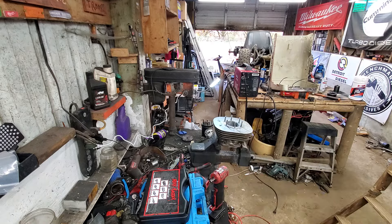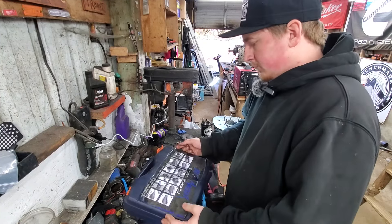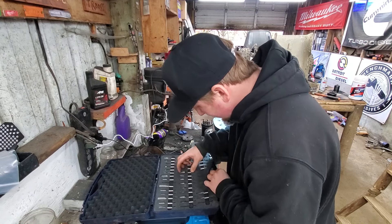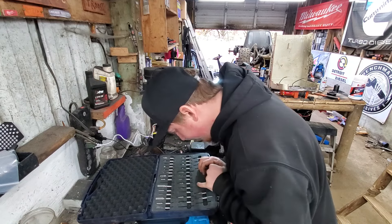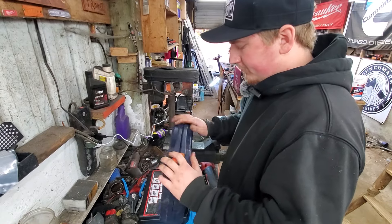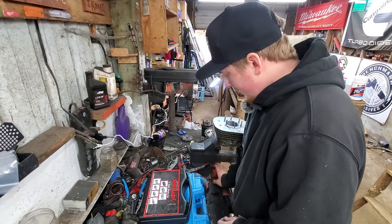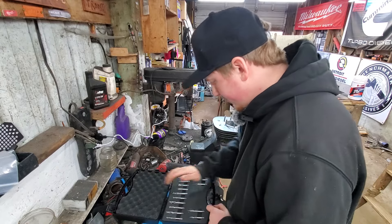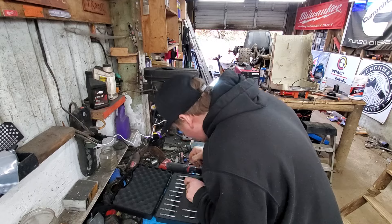This goes in this kit — this is H5, I got SC1, or SB5 out, SF1 and then SFL. But these are for steel and we are not cutting steel, we are cutting aluminum. I think that's where my problem was occurring — I was cutting aluminum with steel burrs, which is possible but it burns the burrs. So we're going to go ahead and get one like that.